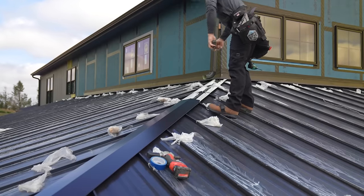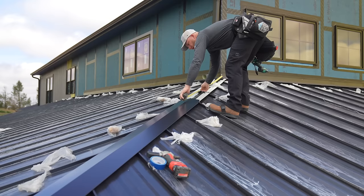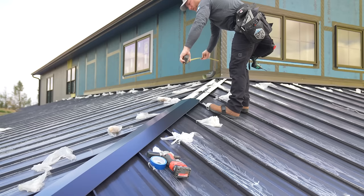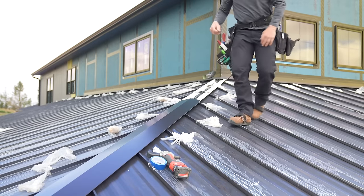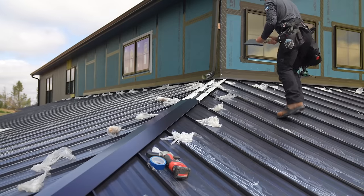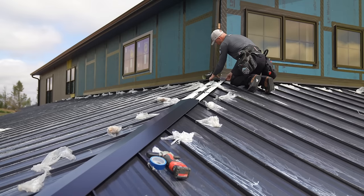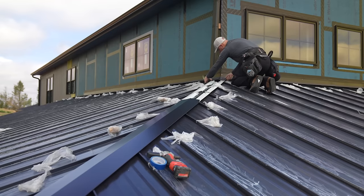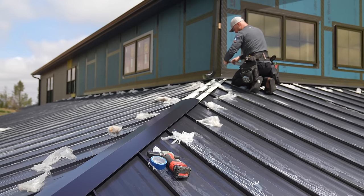Since this is not going to take a full piece of hip caps, I'm going to cut my hip down so I can make a template for the top to make sure I get the right cut. We're going to be about 88 inches plus a little bit — let's just say 8 foot. So I can cut myself a little piece and use it to figure out exactly what I'm going to do up here on my angle. Nice thing is with a template you can do your test fits and make an adjustment without having to make a whole new piece — you just adjust the cut on your template and once you get it perfect, transfer it over to your actual piece.